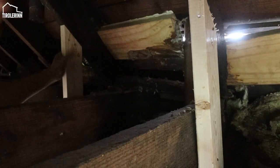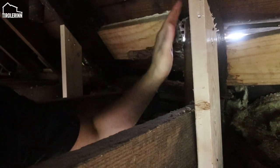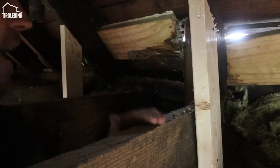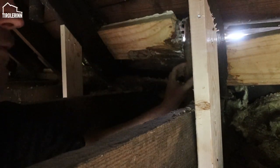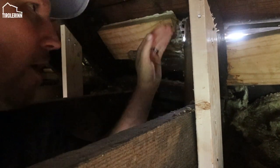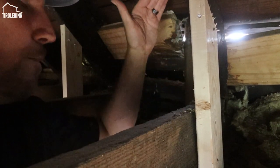So obviously we have these studs that I'm shoring up the roof a little bit. I'm using the bottle jack to raise the roof. The rafters that are over here, basically the ones that are coming down vertically in a diagonal fashion with the roof line, I am just supporting them more. They are about 1 to 2 inches too low in most spots, so push them back up.